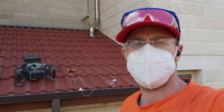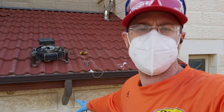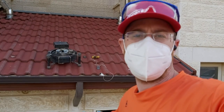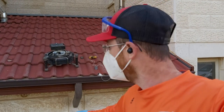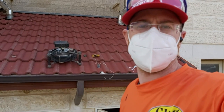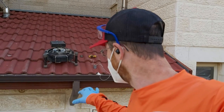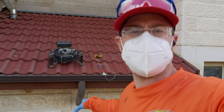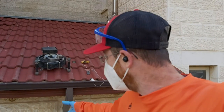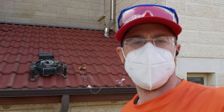All right, so basically to rectify the problem, they're going to have to open that connection up over there. Really what should happen is they should pull that plastic polypropylene pipe just to the edge of the building, and then connect it properly so you're actually going inside, and then seal around that. But the plastic piping shouldn't be inside straight down, because then you're having that bad angle coming out of the building. Then you can seal around it when you put the aluminum pipe inside.